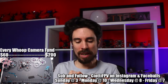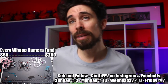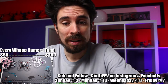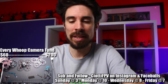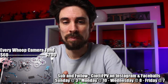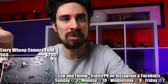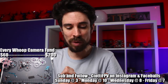I guess the argument here would be that we had to solder anyway because BT 2.0. But, you know, Happy Model could have made the exact same AIO and pre-soldered on an A30 connector. And they could have absolutely owned, as if they already didn't. I mean, they already did. But they could have picked up even more of the Tiny Whoop crowd with a solderless BT 2.0 A30. Easily motor swappable. Put these same motors on. 0702, 28,000 or 27,000. Great. Awesome. Put those on. But then you can just plug it. You know what I mean? They could have made something really, really good.